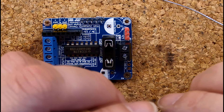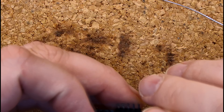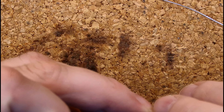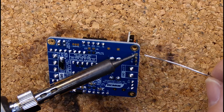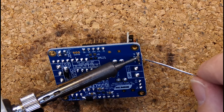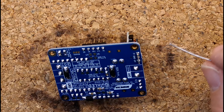The next step is optional. If you want a 5V-only board, you don't need to solder this DC-DC converter. But if you want your board to be 12V compatible also, you will need to add this component. If you're not going to use it and want your board to be 5V only, you can just leave it off.